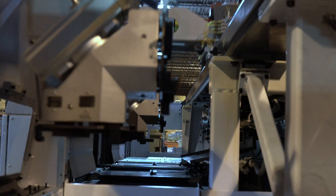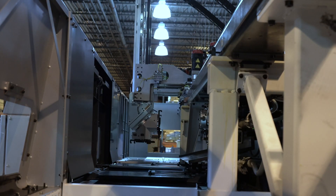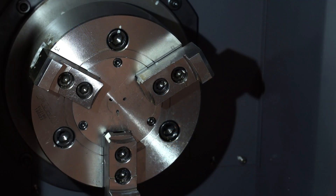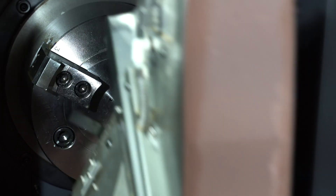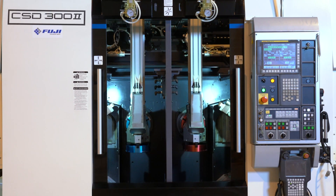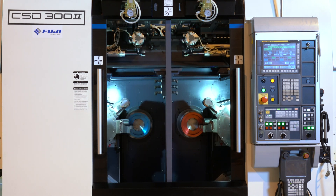Some of the other enhancements to this CSD-302 is the turret indexing time at 0.19 seconds. We're capable of obtaining robot cycle times at a minimum takt of 17.9 seconds in some operations. We're also capable of obtaining loading times under five seconds. One of the features of this end-of-arm on our dual gantry system or our single gantry on this machine model is the ability to air blow for cleaning and also sensing clamping and unclamping.